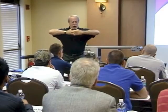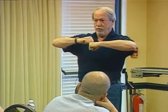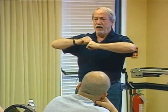Some of its drawbacks may be what we call shock load capacities. Polyesters, when they receive a shock load, in other words, a guy's planing a piece of wood, it hits a knot and that belt's trying to pull and it can't. That belt will stretch out to a point. Polyester will not come back to its original size like nylon core might.